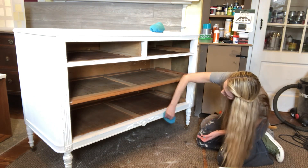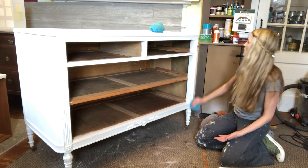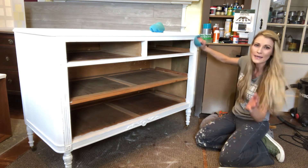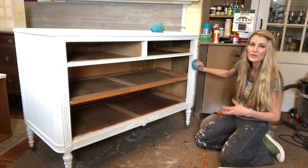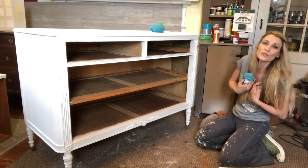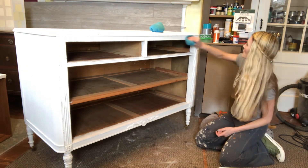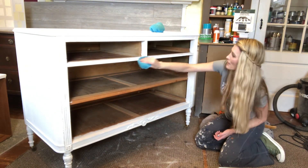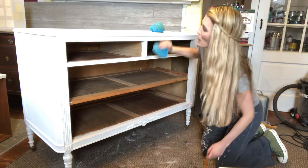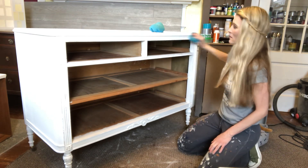What types of furniture do you apply wax to? I apply it to coffee tables, dressers, and frames around mirrors. The only thing I don't apply wax to: when I sand a piece and stain it, I always apply a polyurethane over the natural wood. I probably wouldn't wax a dining room table top either — any piece that gets a lot of wear and tear I'll do a polyurethane instead. Wax is durable, but for high-traffic pieces I prefer poly.